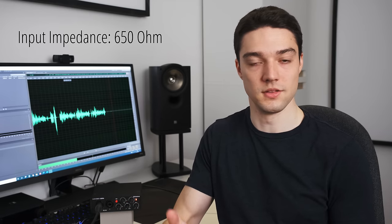If you want a third reason why you shouldn't use a dynamic microphone with the Audiobox, it would be the input impedance. To not change the sound of a microphone, the input impedance should preferably be as high as possible. Many interfaces have an input impedance of around 3,000 ohms, which is okay, and 1,000 ohms is what I would consider the tolerable minimum. Sadly, the Audiobox only comes in at around 650 ohms, which can have a noticeable effect on the sound of your dynamic microphone. All in all, it's a sub-par performance of the microphone inputs.